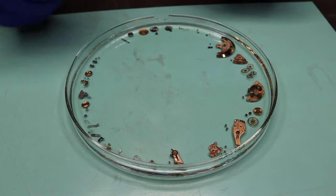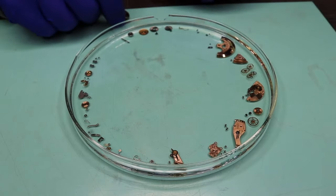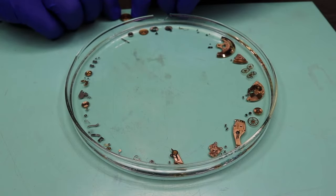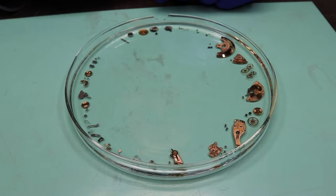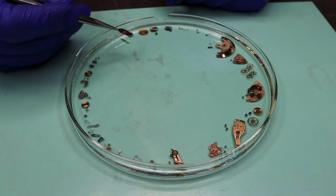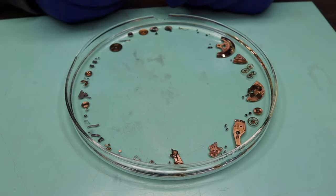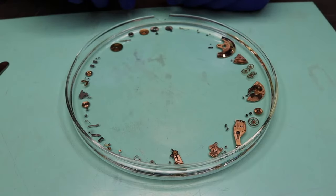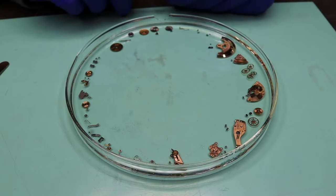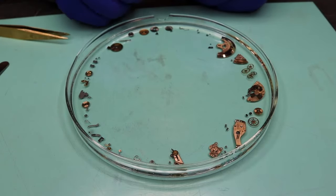So, oh my god, the mainspring barrel is just leaking oil. I turn the mainspring barrel upside down, and I press on the arbor, and it pops open, just like that. Simple as that. Oh my god. Here's the mainspring barrel cover. The arbor. The arbor. And we'll release this mainspring.